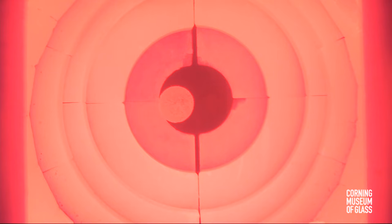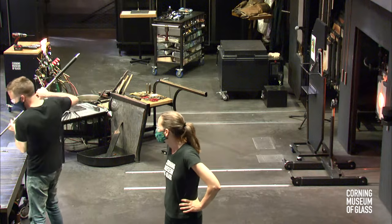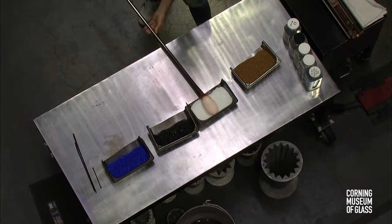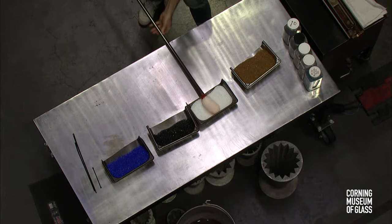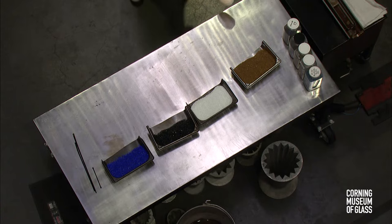So you'd actually put it up to your mouth and blow through it. It just looks like a tube with a cone on the end. Or there's a bent Sofietta, which the gaffer sitting at the bench uses. The tube comes out and then bends over, so you can inflate the piece you're making from the bench. All of which we're not using at the moment because of the mask system. So we are using the compressed air for the Sofietta as well.